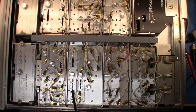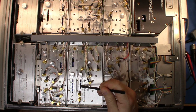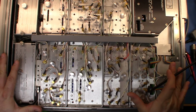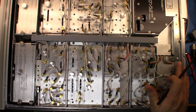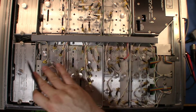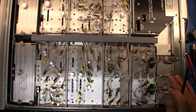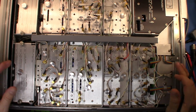And you can see through the loop gain here, the doublers and so on, that there's a bunch of tuning capabilities. So these things must be adjustable to bring it back into specification if they drift way out. Fortunately, this guy passes all of its manufacturer tests. As I was saying, I had a chance to get into the Keysight Cal Lab at work and run it through the actual Keysight calibration procedure, and it passed all of that. So it's a good unit, working well and within spec.